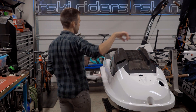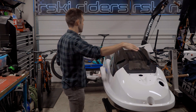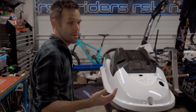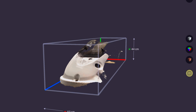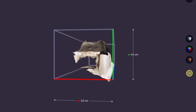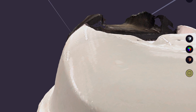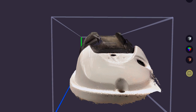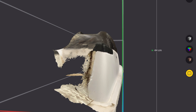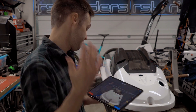So maybe I would do that section, flip it around, do the other side, and then do this top section with the tray, then put those meshes into Mesh Mixer and end up with the full jet ski. Looking at it now, we have nothing below the bond line at all, but it looks pretty clean. Wow, that looks really straight. It seems to do the white a little bit better than the black — the more reflective white surface is doing better with the LiDAR. So spray paint your ski white and then maybe you could 3D scan it better — just kidding.